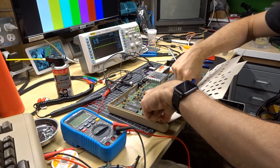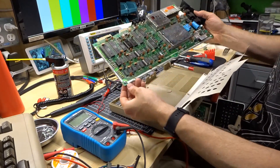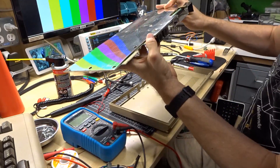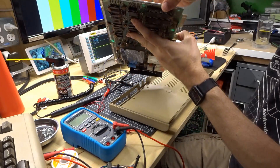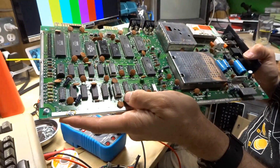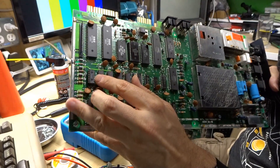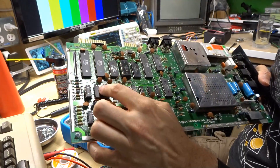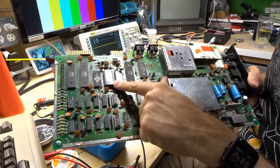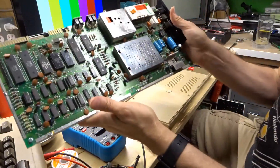There are broken standoffs on the bottom because those are just spinning, but it should come out anyway. Someone went through the effort of putting some sockets in and then re-soldered the shield back on. You can see these are the two sockets — they're white, definitely not OEM. At least this machine doesn't have any of the MOS logic. There's also a 7406 chip in a socket, the RAM is Fujitsu, and there's a ROM here that looks socketed but could be original Commodore. We'll see more when we take the bottom off.